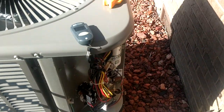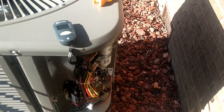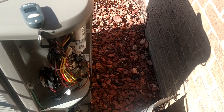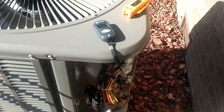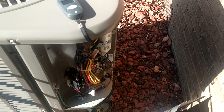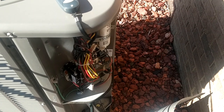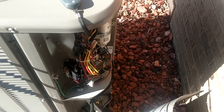That is a hell of a difference as far as charge goes. The difference between 18 and three — you're talking pounds and pounds of refrigerant, either over or under charge. Let's say you're one of those guys that think it's not a science and you put it on 10. Well, if you did 10 in AC mode you're seven degrees off, if you did 10 in heat mode you're eight degrees off.